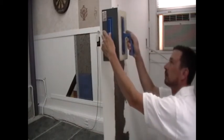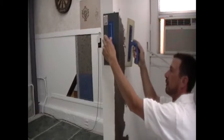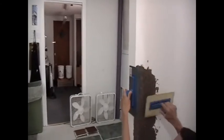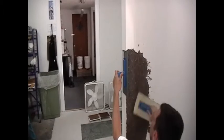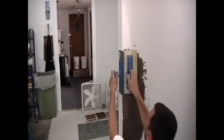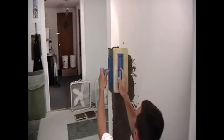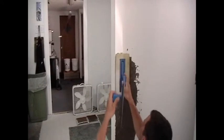He slides the clean trowel onto the clean wall, pushing any excess material away from the clean wall and creating the false inside corner. He will then work on this false inside corner area to create a clean, crisp edge that is at appropriate thickness and without voids.